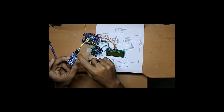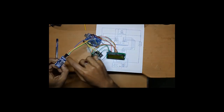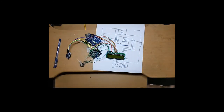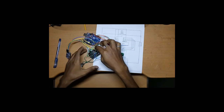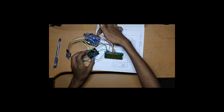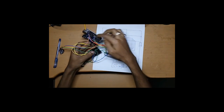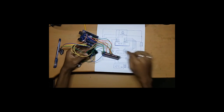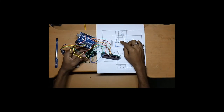The clock module's SCL line (blue wire) connects to analog pin A5 of the Arduino, and SDA connects to analog A4. Its +5V and ground connect to the common rails. For the LCD display, the anode and cathode connect to +5V and ground on the breadboard, the four digital data lines go to Arduino pins 5, 4, 3, and 2, and the connections from Arduino pins 12 and 11 go to RS and E.